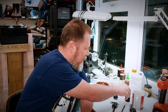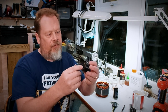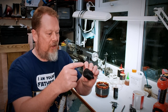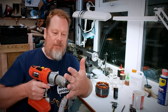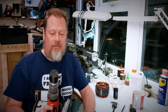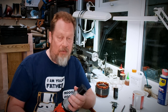I did actually have a version one of this. This was my version one degaussing machine that I made. It's basically a 3D printed cylinder with a spigot poking out of the back, a bit like the chamber on a revolver. It's got four holes, and each of these has a great big 20mm long neodymium magnet, arranged alternately - north, south, north, south. The idea was you would put that in a drill and spin it, creating an alternating magnetic field next to the things you want to demagnetize. And it didn't really work. I didn't troubleshoot it very far, so I gave up on that until our food mixer went Tango Uniform, and I was able to rip that apart and make a more professional model - hopefully. Version 2.